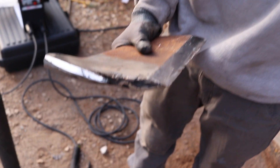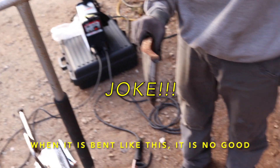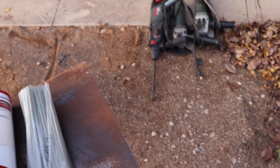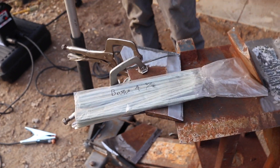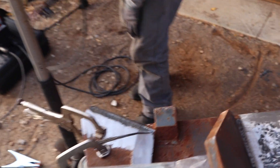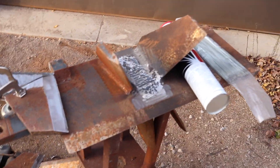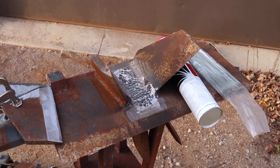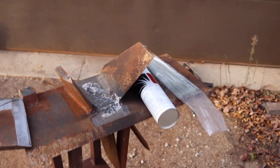Here's a before picture — has a natural curve to it, makes it real nice, reliefs the wood. Tim air-arched that out already earlier. We're stick welding this on with Rock Mount Brutus A. That rod has like 130-some-thousand PSI tensile strength. You can't torch it off with an oxyacetylene torch — there is some stainless in it. If you really need strength and want it to never tear out, that's the rod you want to use.